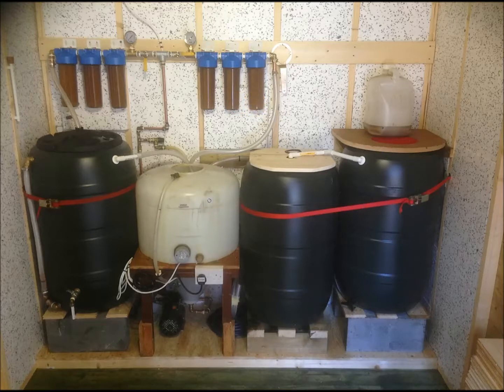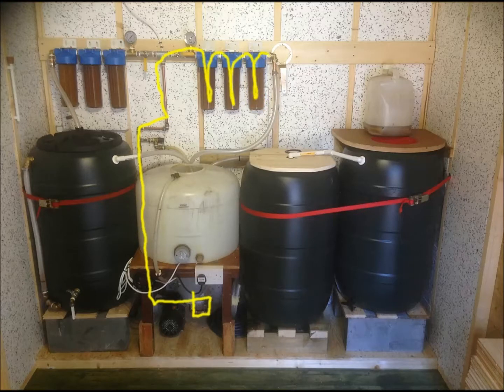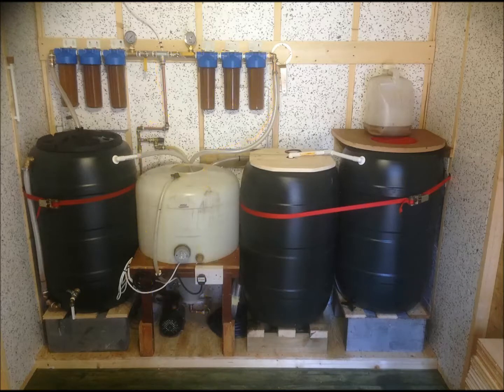I need to get the oil from this tank, where it's all just drained into, through these filters, into the storage barrel. So what we do is we turn on a pump — there's a pump here. The pump goes on and it draws oil from the bottom of this conical tank. You can see there's a pipe that runs up the back here, through the first filter, through the second filter, through the third filter, and back into the barrel. It's a constant recycling — we're just circulating that oil backwards and forwards through these three filters.